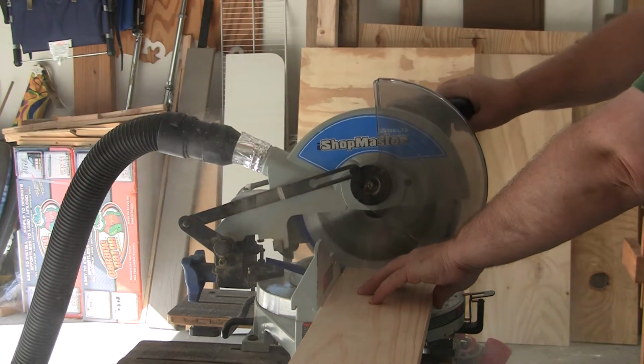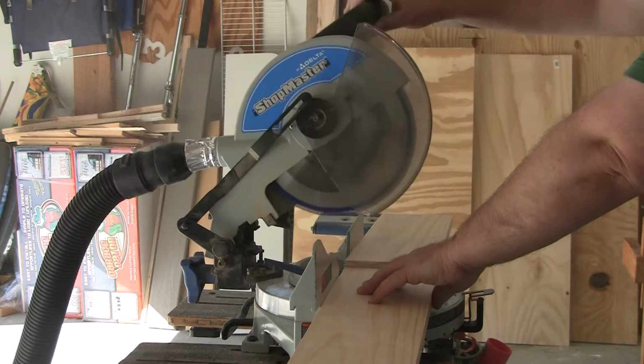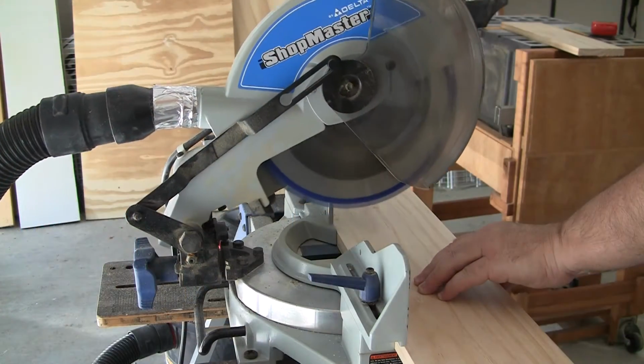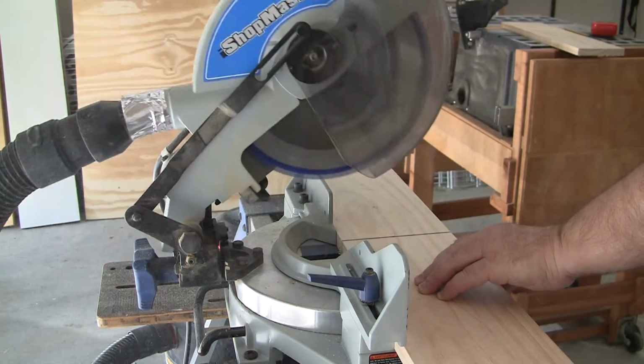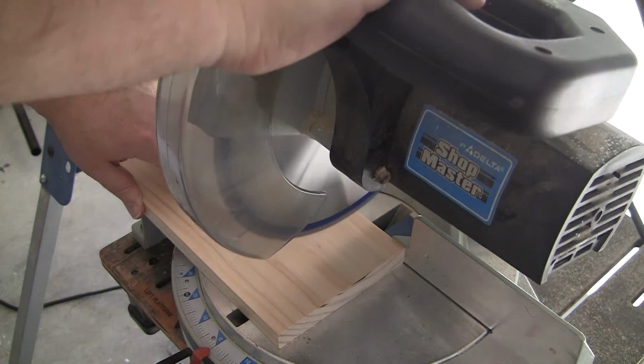The first cuts we want to make are just rough cutting the board down to length. The first at 20 inches and the next 2 at 25 inches. After we rip the boards, we will then come back and cut them to their exact length needed.